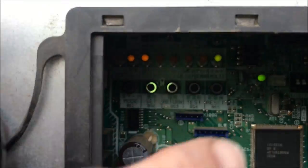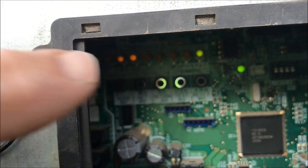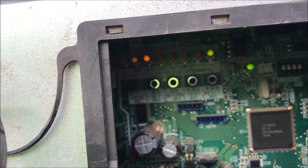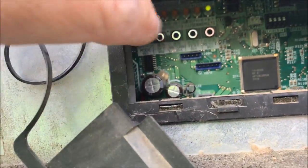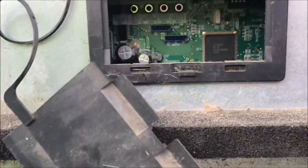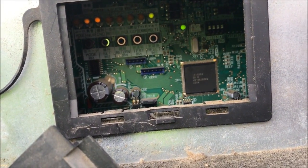You also just need to double check. When you see the lights in there, the slave side will normally only have a green light, and then on your master side H3P will be lit up, and H2P is lit up right now because there's an error. So I'm going to go into monitor mode, and since it's dark out here, I'm going to take the cover off so I have easier access. When it's really bright outside, you need this cover on so it shades the board so you can see what's going on. Let me get the board off and get set up, and I'll show you how to put it into monitor mode and verify what your error is, and the next steps to take care of it.